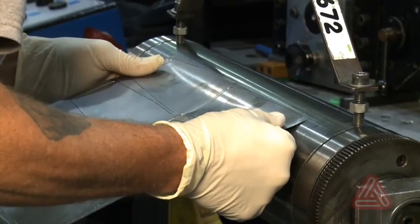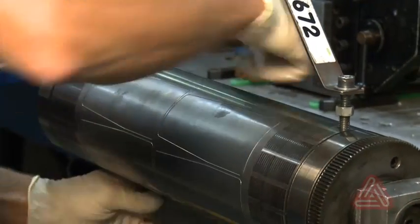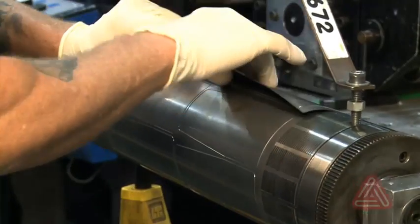For flexible dies, have your supplier verify the suitability of any existing magnetic cylinders and thoroughly inspect them for signs of damage. You'll also want to thoroughly inspect your anvils for signs of wear and damage. If you're using any scoring knives, make certain that the blades are sharp and clean and that they spin freely.